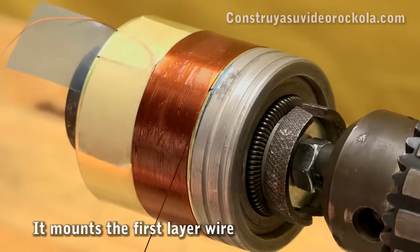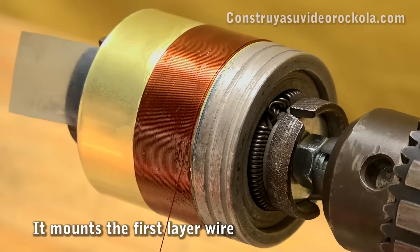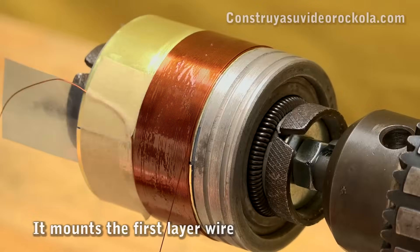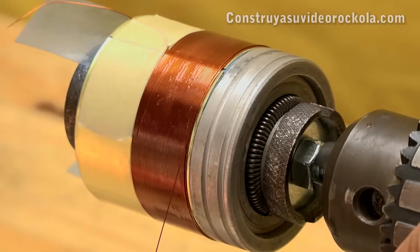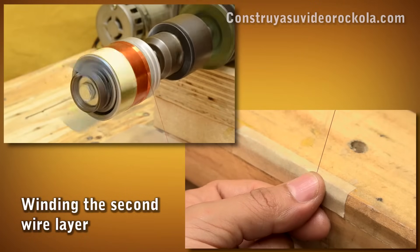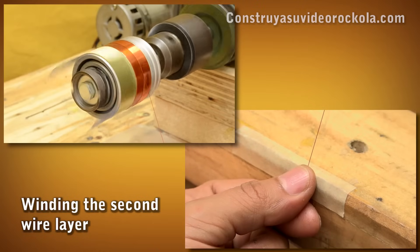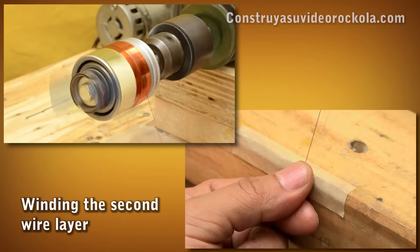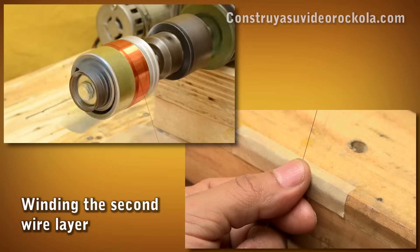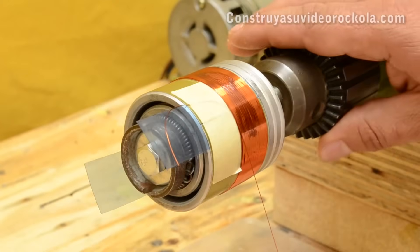To make the second copper winding layer going back, it must be rolled over carefully — the first turn of wire over the first winding layer. For the second layer, keep in mind the same recommendations used in the first layer. The tension used must be less than in the first layer, so that the wire does not embed itself between the bottom wire.